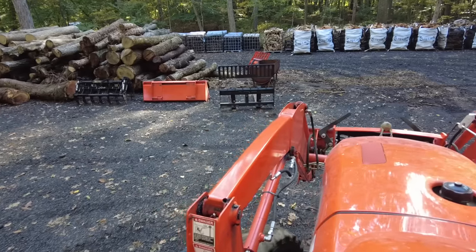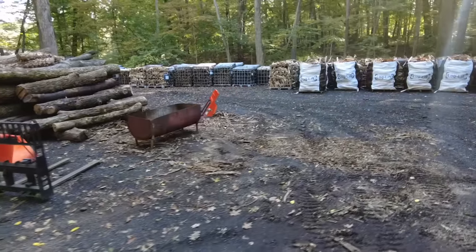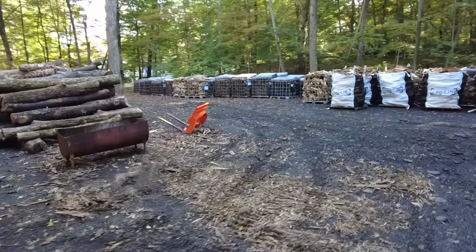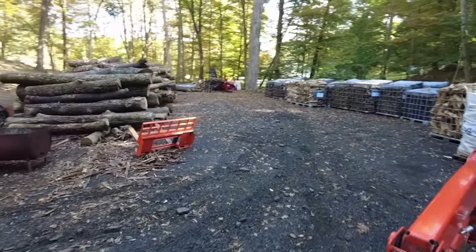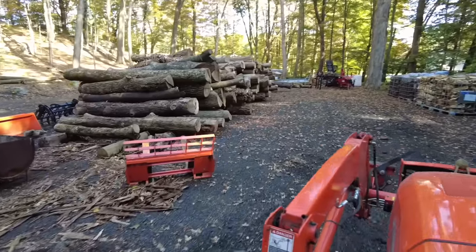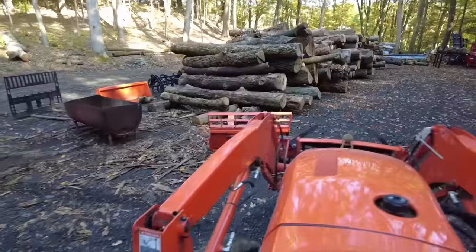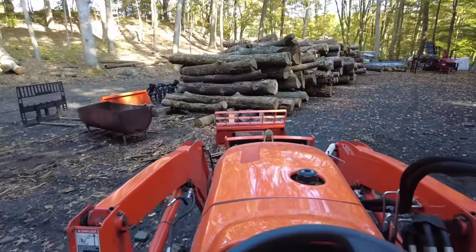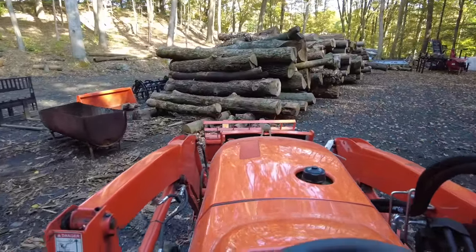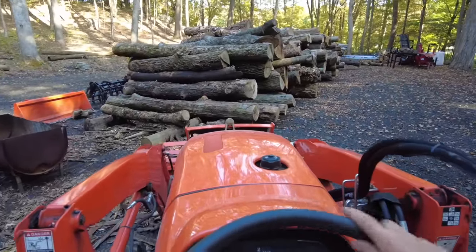So guys, we're gonna drop the big 48 inch long forks and hook up to the little shorties. I think they're like 32. When loading into the back of the dump trailer as opposed to the dumpster can, the deck of the trailer sits at about 29 inches high. So that's about like 20 inches of lift that I'm actually losing on the tractor. So having these shorter forks helps me lift them up and out of the bottom of the IBC totes.